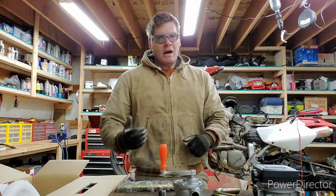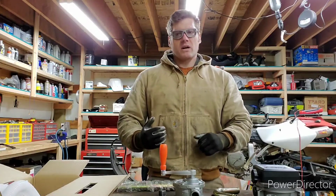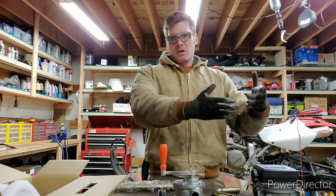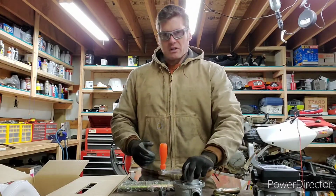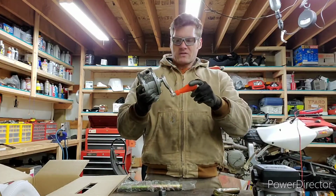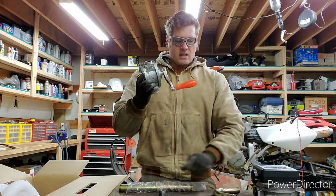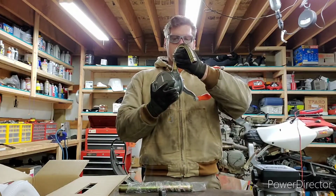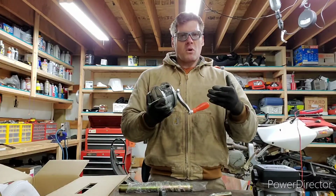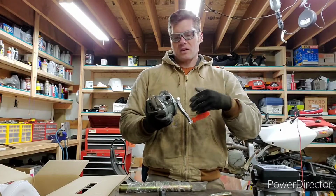done. Now, the problem I have is dispensing the oil out of the drum in a way to where I can actually monitor the oil to put it in my engines. Historically, people have always used one of these. It's a simple hand crank pump. Most of you guys have seen these things. It relies on a suction tube, and then it has a dispenser tube on top. Now, the problem with this method is it's great for distributing the oil, but there's no way of actually monitoring the amount of oil that comes out.